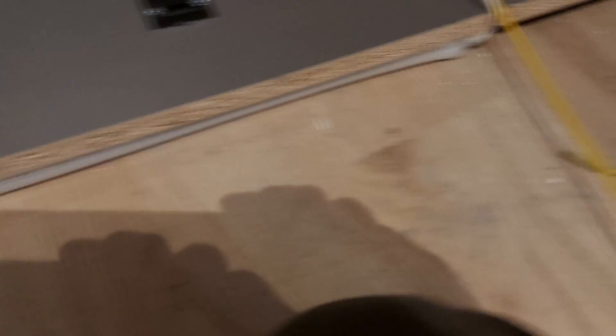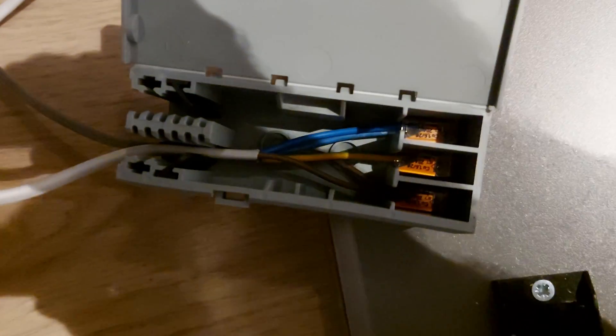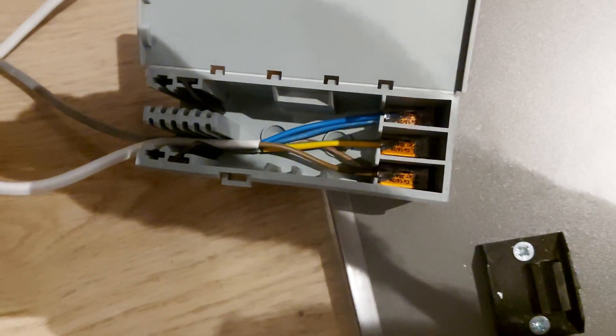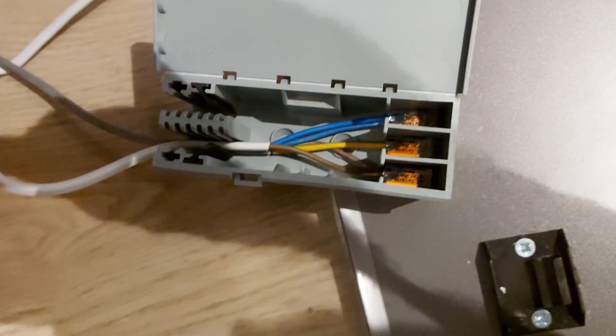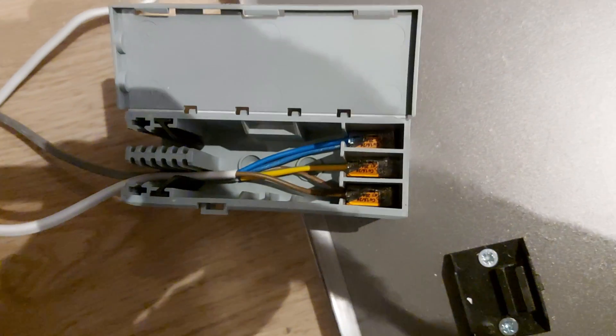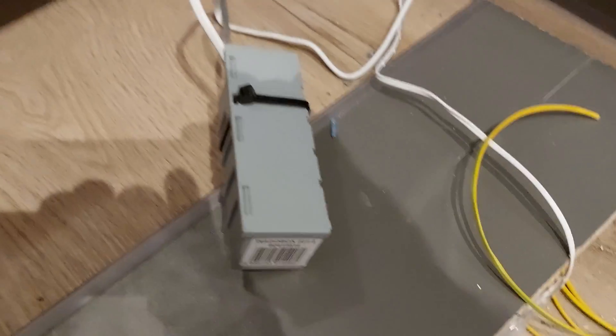The kitchen fitter doing the plinth lights — what a state. This is all his wiring. There's some earth there joining stuff — I'm washing my hands of that. It's 12 volts. I'm just putting a junction box on. These are the WAGO 221-4 boxes, which are the right boxes for the 221 connectors, up to four mil. So that's how this should be terminated — just close that, put a cable tie around it, and now that's a maintenance-free junction box. Junction box finished — shove that under the plinth.